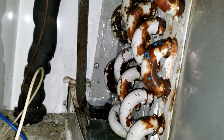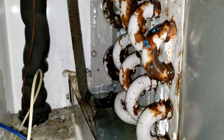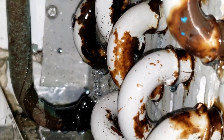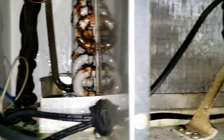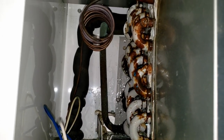It's not the suction line coming out of the coil — actually right there it is. Yep, it's leaking right on the end of that coil that's all screwed up. They're going to need to buy a new coil or consider maybe going with a new unit altogether. This one's done — if it keeps going low like that they're going to destroy the compressor, and they've already got some relays and stuff bad. We'll mark on the inside cover where it's leaking so the next technician doesn't waste a lot of time.